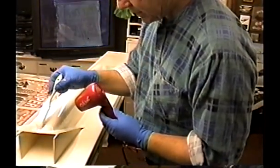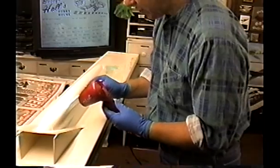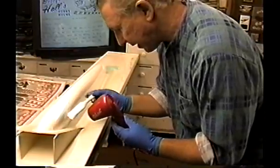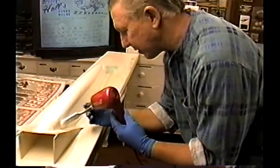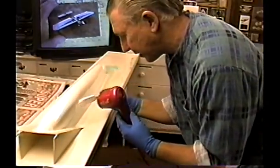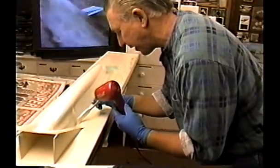Way of trying to get rid of the last few air bubbles, what I'm doing is just the low setting on the heat gun, starting at one side and trying to rake through. Hairs also, these cheesy brushes always leave a few hairs. Oh, there's one as we speak. Get rid of the hairs if possible. Just makes for a little, oh, another one. I feel like I'm mining for gold here, but trying to get rid of every air bubble so that the mold, this will be the surface that the mold picks up right here.